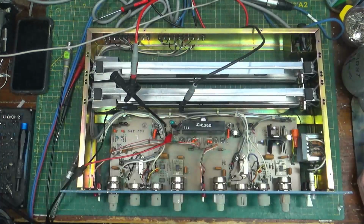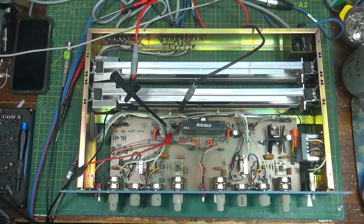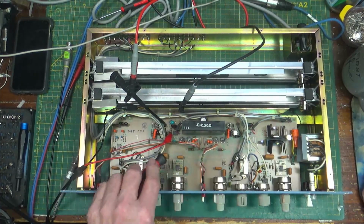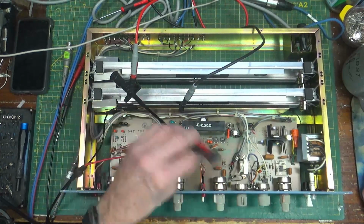The manual, by the way, shows that transistor in there the other way. It's evidently a different FET than what originally came out with this, but it hasn't been changed. So it's just a change in the manual, and it does tell you that the gate is on one end. In this case, it's on that end, so it's gate, source, drain.